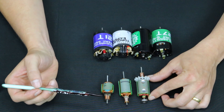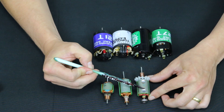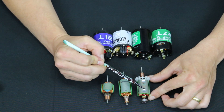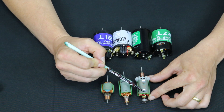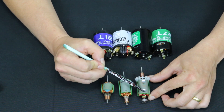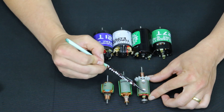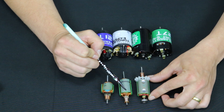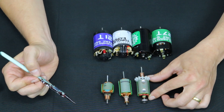When you're counting all the little stuff for a nice motor, it makes a difference. On these, you can see that there's a very wide swath that they took out for the balancing and it's shorting a lot of laminations together. It's still a very small layer where it's getting shorted together, but it does make a difference on the no-load losses. This would increase the no-load losses more than this, and this one would have higher no-load losses as opposed to that sort of balancing.